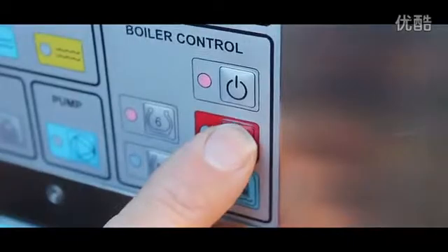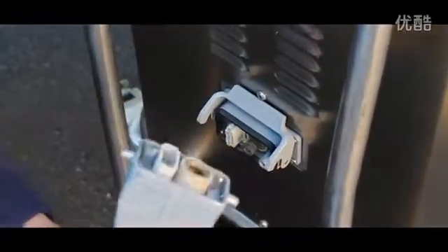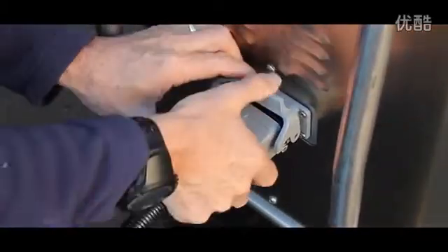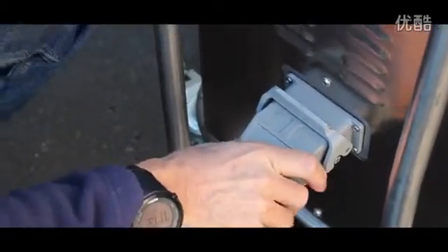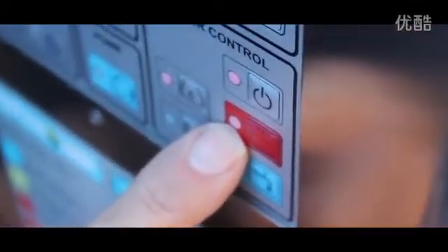So let's turn this off and connect up the hose. Now we get the steam hose and the water hose — let's connect the steam hose first. Turn it on like so, nice and tight — it can only go one way in. Now we'll turn this on and you should hear a big thump — that's the contactor coming on, meaning the main electrical elements are now on.